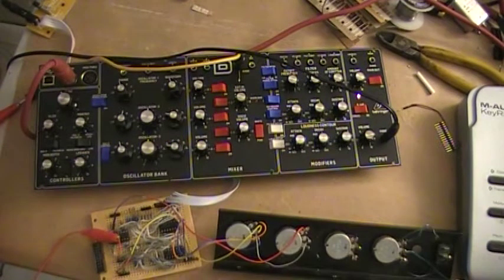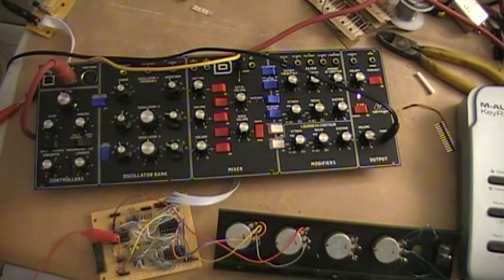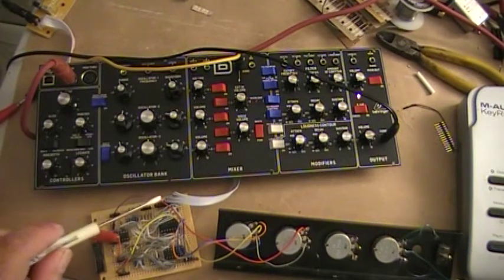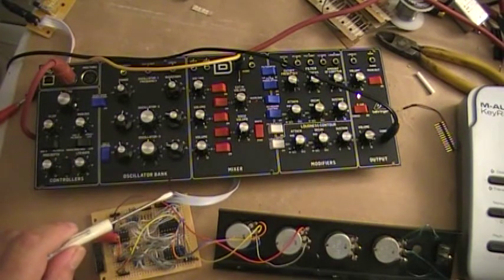The PWM board which I made a few days ago — this is the board. It's wired up to the hot end of the volume controls and comes through this cable. I'm also taking the plus or minus 10 and ground from the Model D.